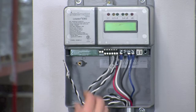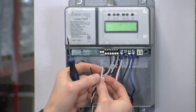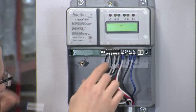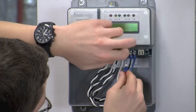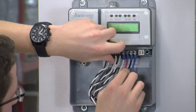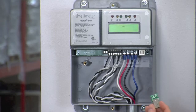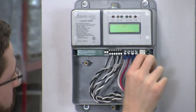We now have our CT leads and reference voltage wires pulled through the conduit into the enclosure. For this demonstration, we have pulled them through one conduit, but I would suggest adding another conduit to keep your reference voltage and CT leads separate. You're going to use a precision screwdriver to terminate your CT leads into the terminal strips — here we're using the bottom terminal strip for CTs 1, 2, and 3, using black for negative and white for positive. As you terminate them, double-check your labels on the CT leads to ensure that each CT lead is in its correct slot. For the reference voltage, we use fork connectors. Loosen off the terminal screws — be careful not to over-loosen them as the screws can easily fall out — and go ahead and terminate your neutral, line 1, line 2, and line 3 wires. Once everything is terminated, give each one a gentle tug to make sure they are all firmly seated inside the terminals. Lastly, we are going to plug in our USB CT programming dongle into the CT key slot. This USB dongle tells the meter which type of CTs are being used with it.